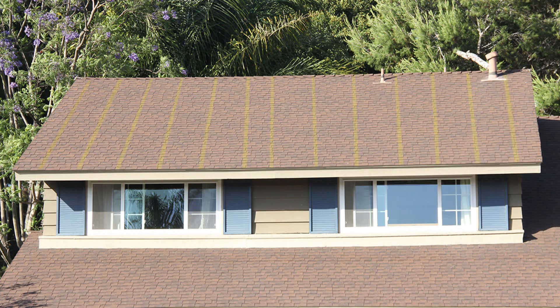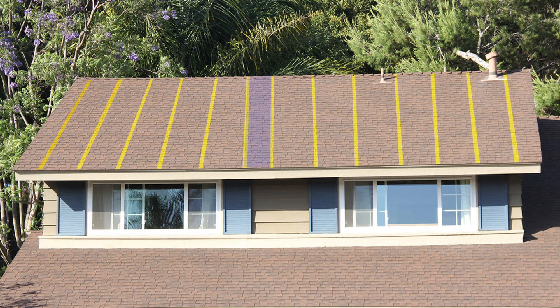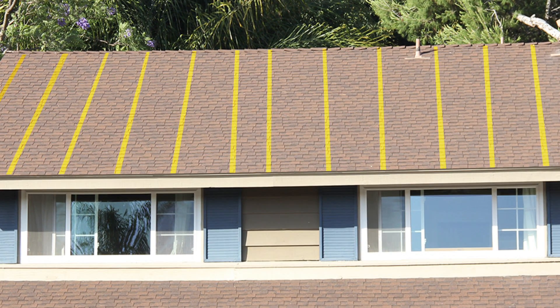You might have a situation where your rafters are not consistently spaced under the array. For example, on my roof the rafters are positioned at 24 inches consistently, but then in the center of the array it goes to 18 inches and then back to 24 inches. Sometimes that means you'll have to install wood blocking to position that roof attachment right where you need it to be.